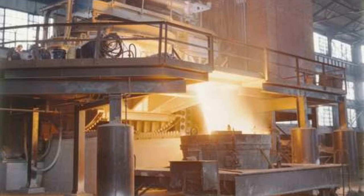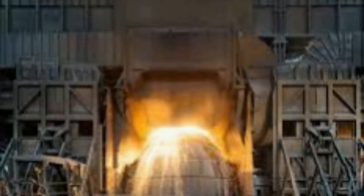In the 1960s, steelmakers introduced bottom-blown converters and inert gas blowing for stirring the molten metal and removing phosphorus impurities. In the Soviet Union, some experimental production of steel using the process was done in 1934, but industrial use was hampered by lack of efficient technology to produce liquid oxygen. In 1939, Russian physicist Pyotr Kapitsa perfected the design of the centrifugal turbo-expander; the process was put to use in 1942–1944. Most turbo-expanders in industrial use since then have been based on Kapitsa's design, and centrifugal turbo-expanders have taken over almost 100 percent of industrial gas liquefaction, including the production of liquid oxygen for steelmaking.